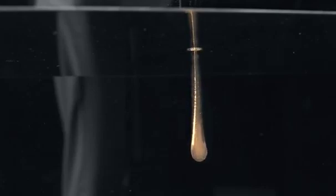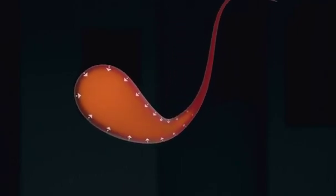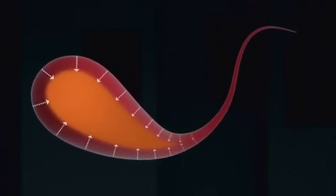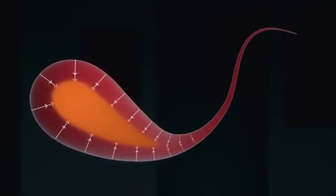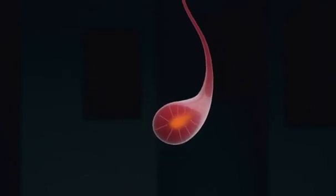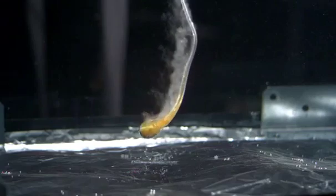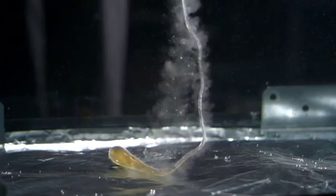So there's a few things going on here. The cold water rapidly cools the exterior surface of the glass, hardening it almost immediately. The interior, still molten, cools more slowly. As it cools, it contracts and attempts to pull the surface in with it, but it can't — not very much. The surface is already hardened, so it gets pulled in only a little, compressing it, while also creating an internal layer that remains forever under tension. It is this action that gives the glass its uncharacteristic strength. We call it compressive strength.